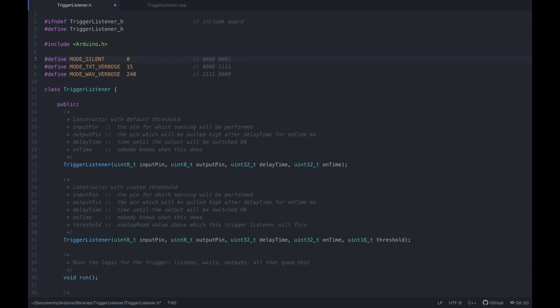I think I have lost an espresso machine due to some similar error, right? So in this case, it is extremely unlikely that we flip all four bits and land in a correct state. What is likely to happen is if some random bit flips, then we'll be in an unknown state, and we'll just go into the default case, which will probably reinitialize it to zeros. So this is just like a super safeguard, a super tinfoil-over-your-head type approach.